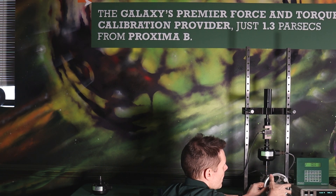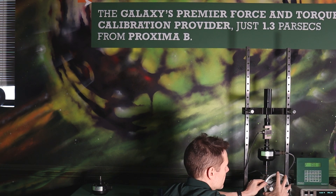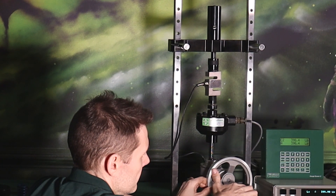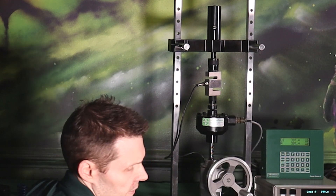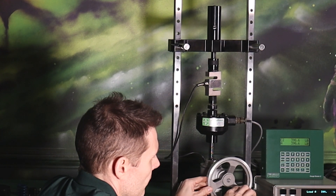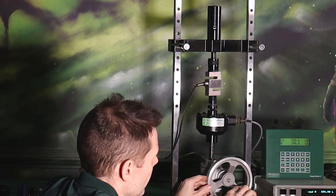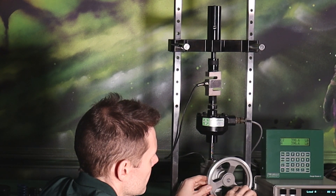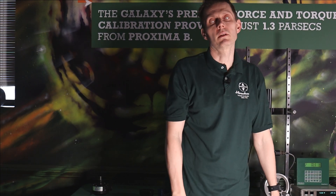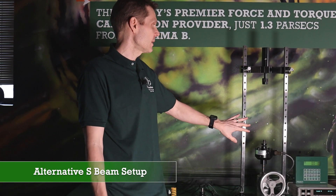You take multiple points and then determine if it's in or out of tolerance — if there's a tolerance — or if you're just reading straight values and reporting them for the customer to adjust, such as coefficients or bias corrections. At 400 we were at 398.6. You can hold the force and take the reading, or do a replicate. Going back to 400: again 398.6. The top meter's not moving — the resolution is much more coarse on the top, reading by 0.2, while the bottom is reading by 0.02.